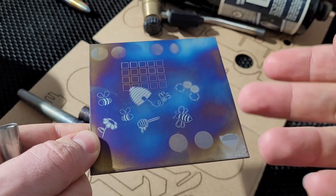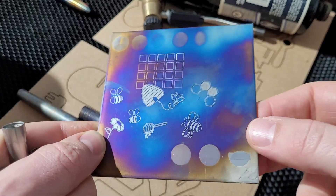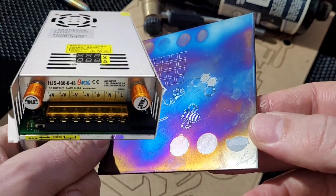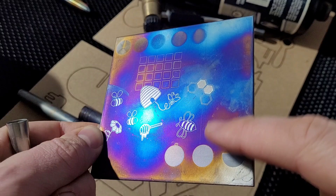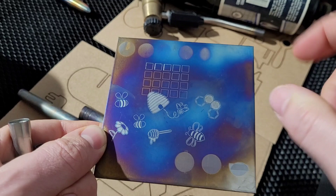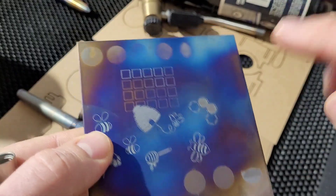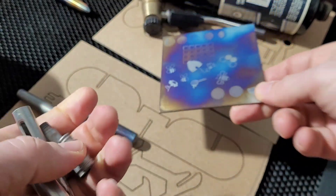It's up to 160 volt DC, so it should be able to get nice greens, which are tougher to get. Thanks to everyone for watching — I get a few bucks from ad revenue and I can buy a cool power supply to do this. So I can control the colors on here better than just with the flame. And then I can ablate some of it. The oxide layer is gone on here, so if I wanted to, I could reanodize it — not with the heat, because it'll screw everything up — but with the power supply and put it at a different color.